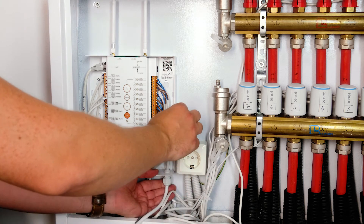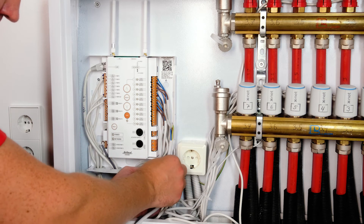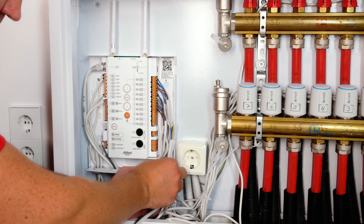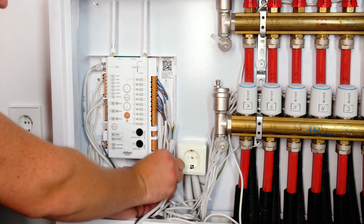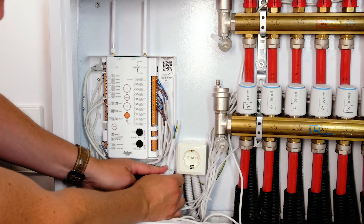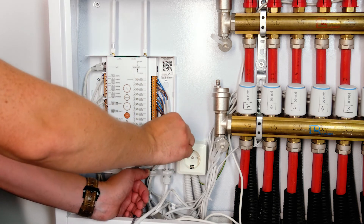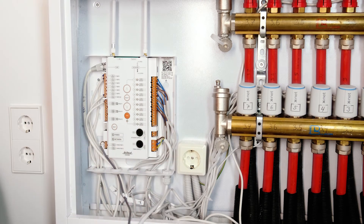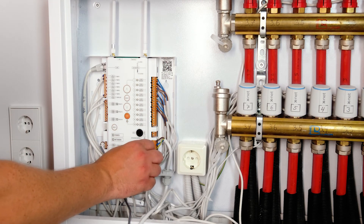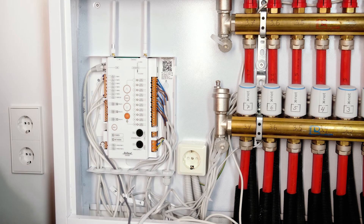5 to 7 cm of cable is ideal for wiring inside the control unit. Tighten the grommet nuts both inside and outside the control unit and make sure that the power cable is securely in place. When connecting the cable, please follow the wiring diagram in the user manual.